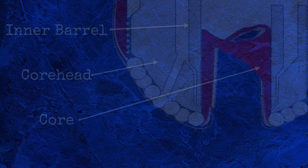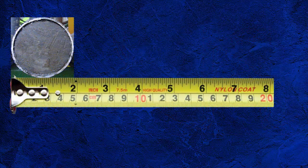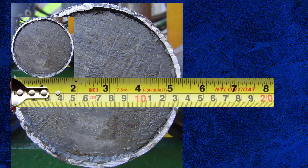As the core head cuts away the formation, it leaves a cylinder of reservoir rock. While the core head makes hole, the inner core barrel moves over the core to provide protection. Upon completion of coring, the drill pipe is tripped and the core barrel is recovered to surface. Cores typically range in diameter from one and three-quarter inch to five and a quarter inch and are usually cut in 30-foot increments. Cores in excess of 600 feet have been successfully cut, though 90 to 180 feet is more usual, depending on factors such as formation, hole size and coring BHA used.